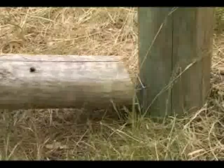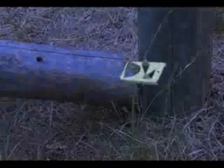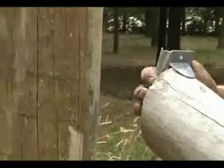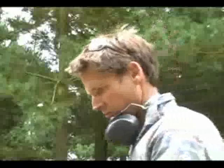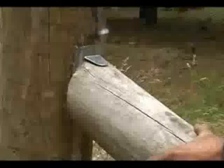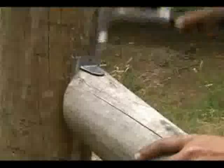The angle stay is then positioned on the bracket. ViceBite is designed with a support ledge that makes positioning easy. Using the support ledge as a guide, a second ViceBite bracket is positioned on the end of the angle stay, then lowered into position on the end post. A few hits on top of the bracket will force it into the stay, and a few more hits on the stay will move it into its final position. As this end is tapped down, the other end also bites deeper — six teeth create a powerful anchor into both vertical posts.